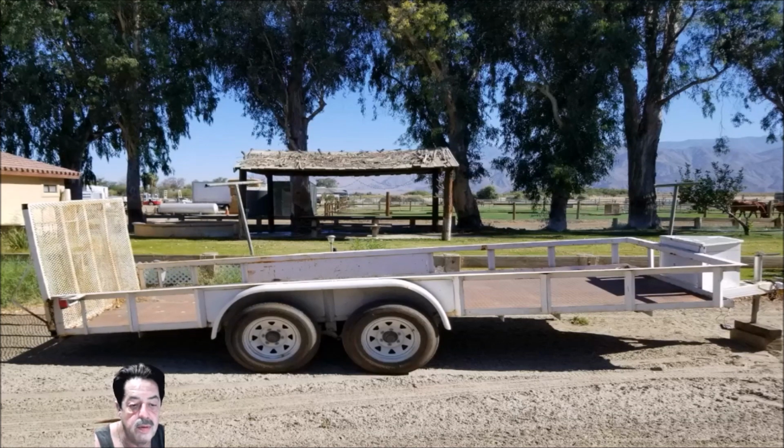Okay, I got in there with my 4.5-inch angle grinder, 80 grit disc. I hit the sheet metal where I could. I hit the angle iron where I could, and I cleaned it down to steel. And then I went ahead and used my MIG welder, and I just tack welded everything back along underneath here. Then I put the tires and rims back on there, and that's what we did for this part of the project.